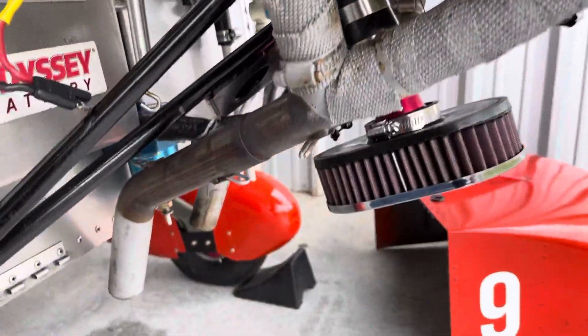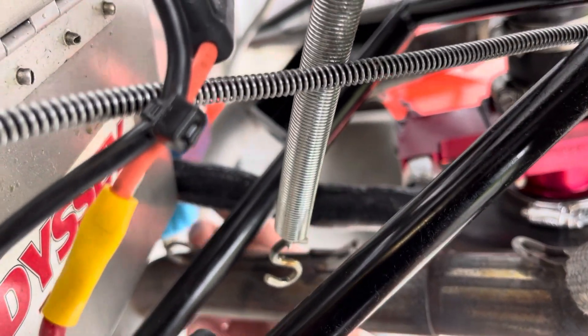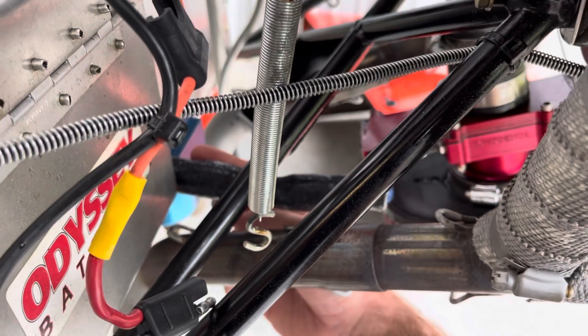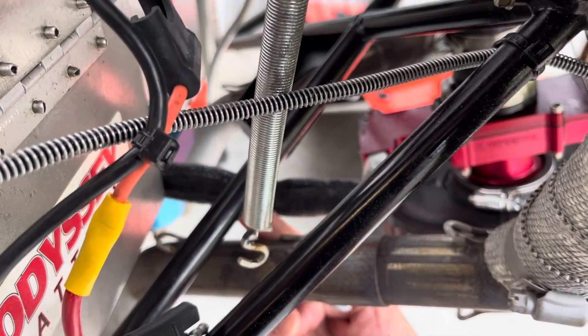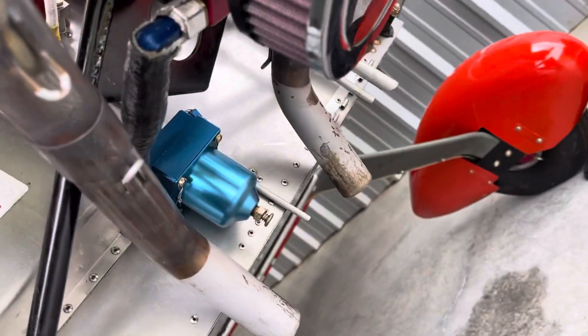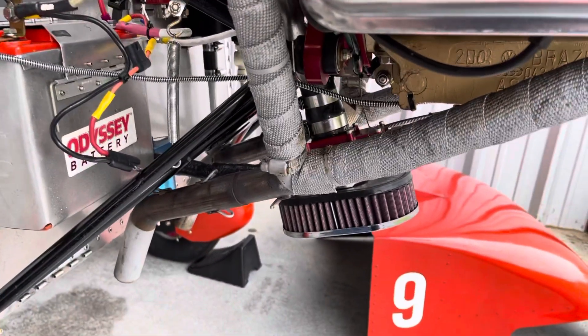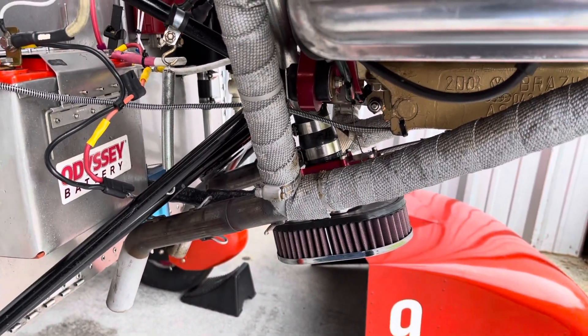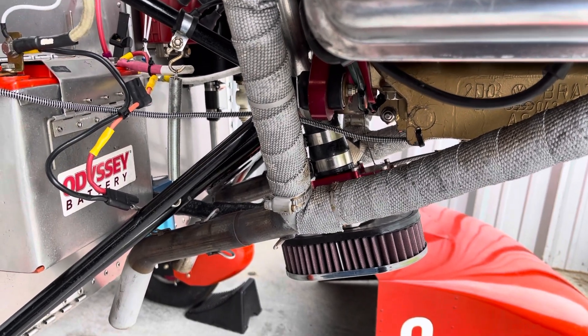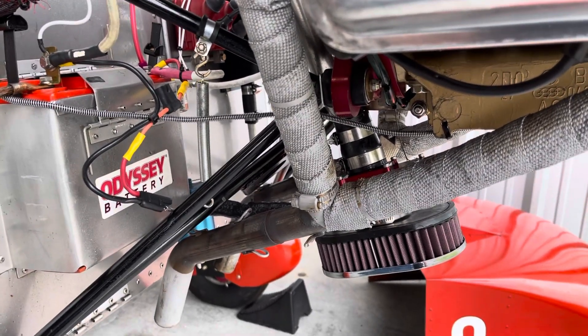The other thing we're looking at is right here — our exhaust pipes are going very, very close to the fuel lines. If you look right here, here's your fuel line, and that is about a finger's breadth away from the exhaust pipe, running like that for probably a good five inches. Here's your gascolator down there, and again, also very close to the exhaust pipes. So that's heating it up. What's happening is you get a little bit of airflow through the cowling while you're in the air, but as you hit the ground, that airflow goes away and things heat up very quickly. The fuel is vaporizing and causing burps and belches and outright vapor lock.